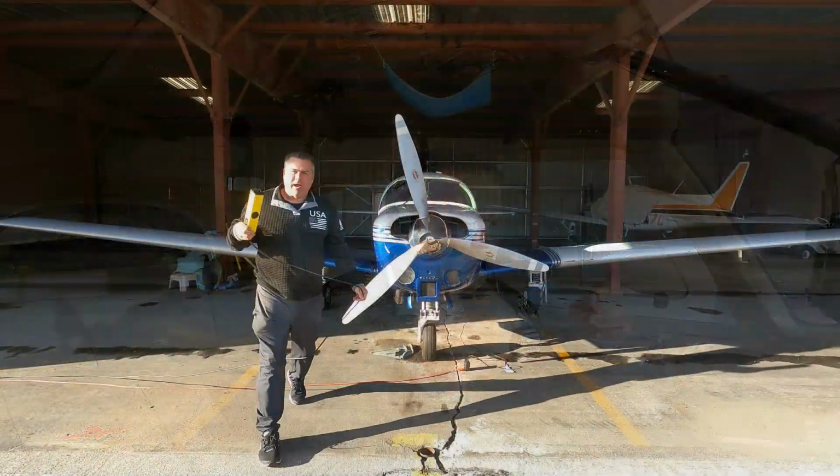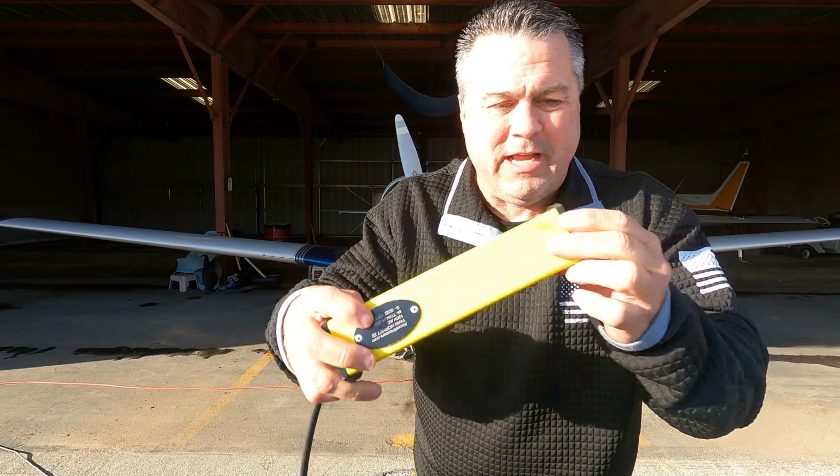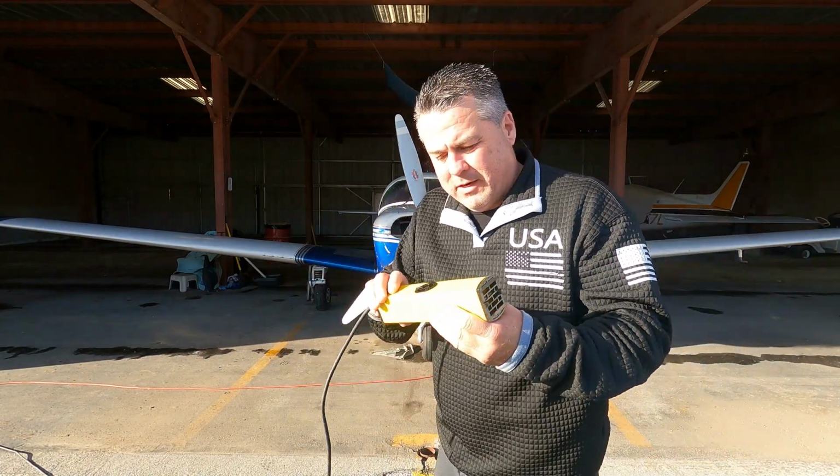The reason I had the blanket over the engine, it's an insulating blanket, and I throw a heater in there. It's a Twin Hornets heater, and that Twin Hornets heater keeps the engine compartment at 70 degrees all the time. It kicks on and off as it needs to. It is a solid state heater, so there's no spark, there's nothing like that. So it's good for the boat.